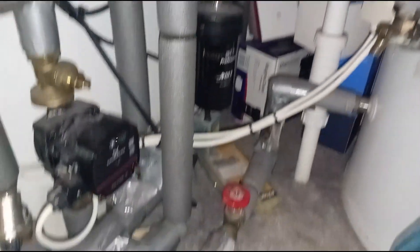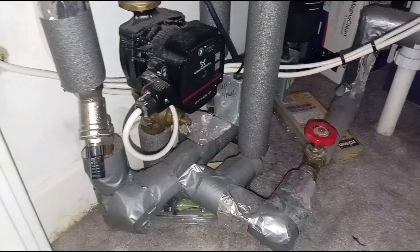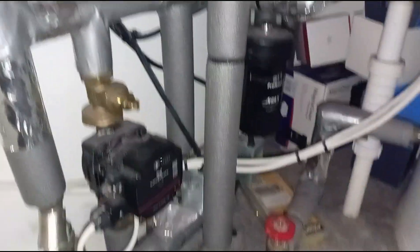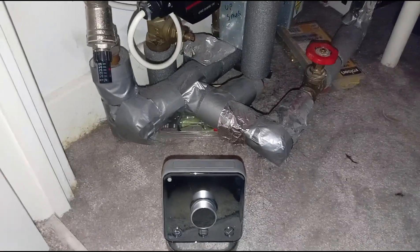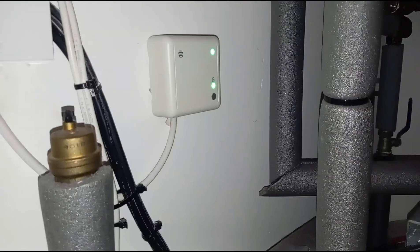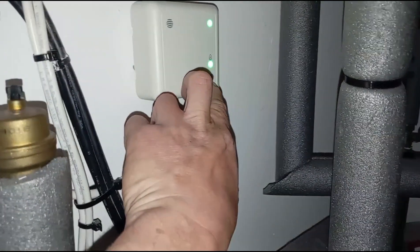So that's pretty straightforward. If you've got a setup like this with three valves, this is actually a zoned system — upstairs and downstairs plus hot water. It's not a combi boiler; it's a system boiler with a hot water tank and a zoned system. You will need a thermostat and a receiver for each zone, so one upstairs and the double channel one downstairs with two lights.